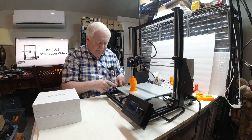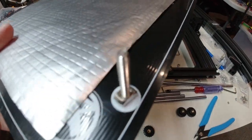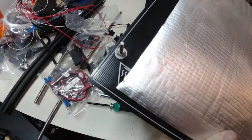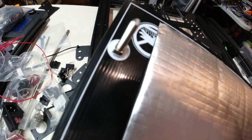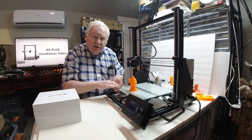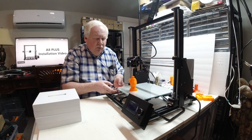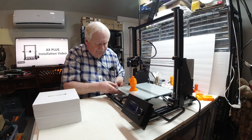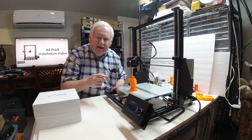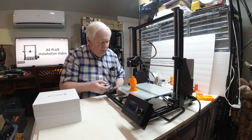What I do instead is put the screw in, then get a 3 or 4mm nut depending on the screw size, and tighten that nut down so the screw is in a fixed position. The reason I do that is I've had situations where I'll make three turns with the bottom knob to adjust the plate level, but the screw head actually turns some too — giving a false indication of how much I'm adjusting. I've included a little video clip showing where I put nuts on the bottom to hold it in place.